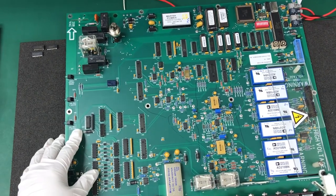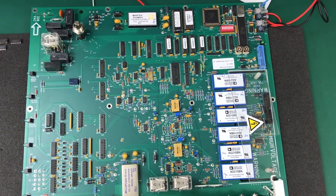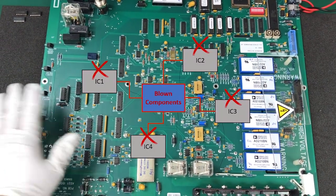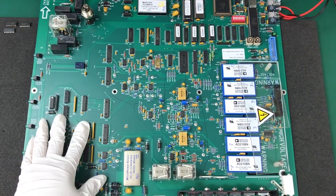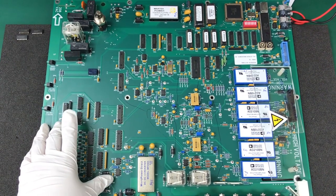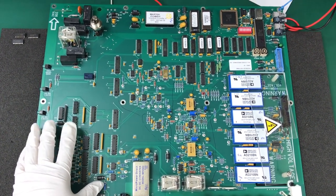Once you find something on visual inspection, trace all the components connected with the damaged area, mark all the components involved, and do component-level troubleshooting on each. If you find an IC is involved, it is recommended to proactively replace it because ICs are very sensitive to electrical overstress — it might be a walking-wounded IC that will soon fail totally. Once all components involved are checked, replaced, and repaired, send the circuit board back for functional testing.